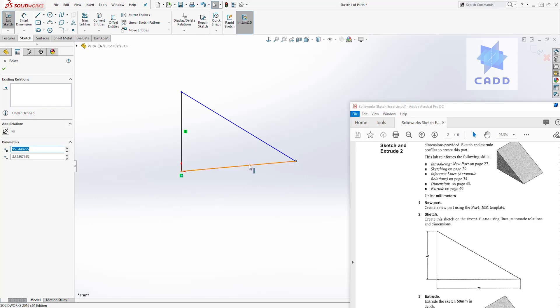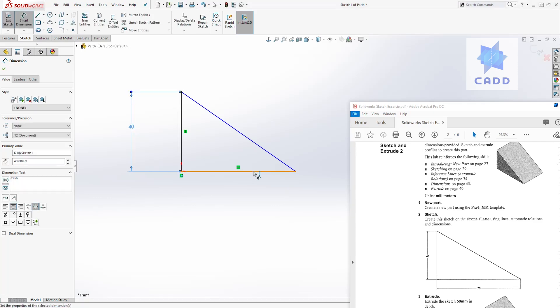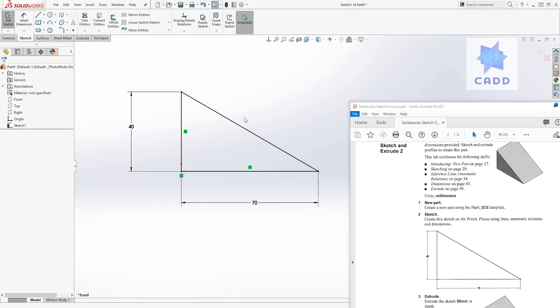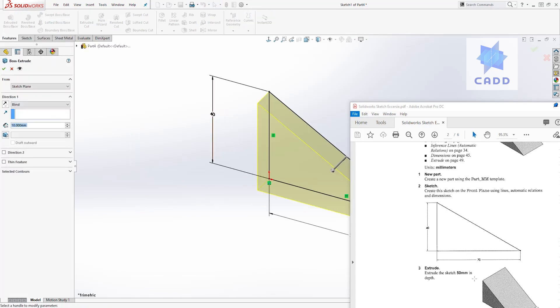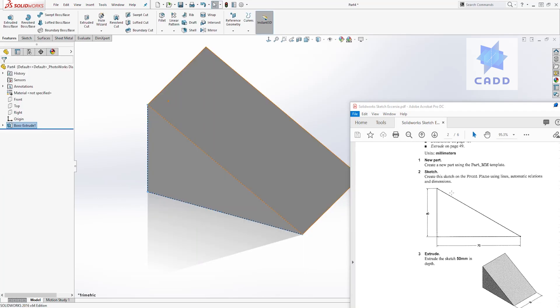You can see that my line is crooked and needs to be horizontal just like in the exercise sketch. To add the horizontal relation to this line, select that line and click horizontal relation. Then click smart dimension and add the dimension of 40 and the dimension down here which is 70. Now I have a fully defined sketch. Go to features, select extrude — the distance is 50 millimeters, so change this to 50. We can also reverse the direction for this one. Click OK and that is how you create this sketch.